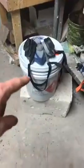So we'll beauty coat it. To make the beauty coat, what I'm going to do is mix up the fiberglass resin and the Bondo in kind of a 50-50 mix. So more or less we keep the old cans of this. You can tell it's a bit runnier.